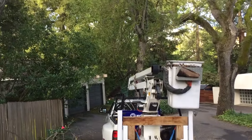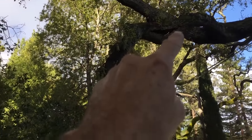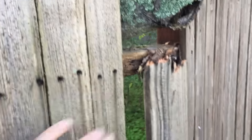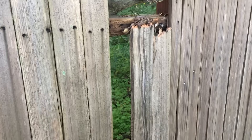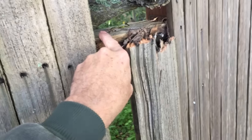Did bring the bucket truck. Looking over the fence I can see that it is not resting on the ground. The entire weight of this branch is being held up a little bit up there and right on this edge, so this fence is holding up everything. It might be a good idea for me to cut a piece of wood and add to this support - put a base piece down there and prop it up underneath here - to take a little bit of weight off so this doesn't come crashing down and make this a more expensive job for the client.